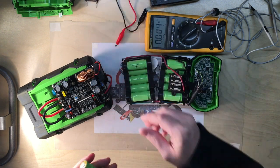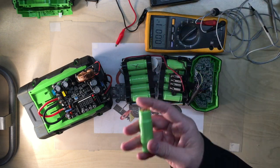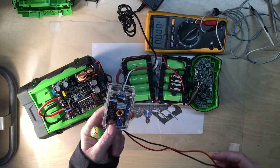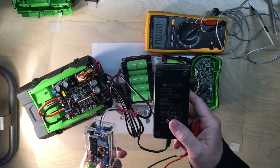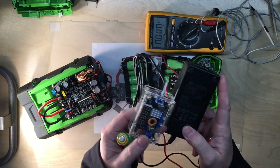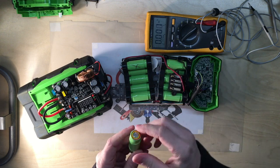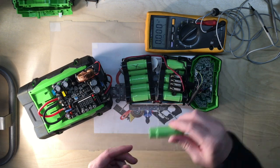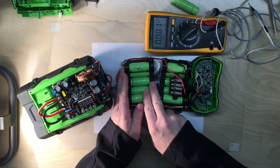When I can, I'd rather charge up to where I need to be. On this one I need to charge it just a little. I could bring in a small Yiko power supply — it's small, just a little switch-mode power supply. Anything below 24 volts I can set for voltage and current; it does the same thing. That works fine for individual cells or several cells in a pack, depending on how many bad ones you have and what voltage you want to reach.